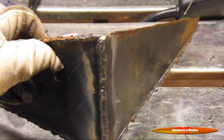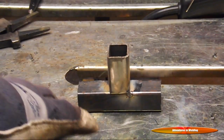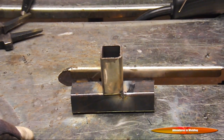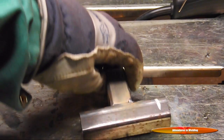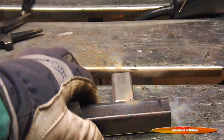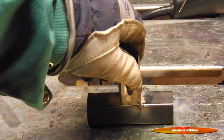Let's move on to the tubing joint. Here's our square tubing joint — I've already got it tacked and ready to weld. We're going to have two separate types of welds here. On these flat faces, this is going to be what's called a flare bevel groove. This is our first bevel groove on the flat side — I'm just sweeping back and forth across it as I move down the length. There's really nothing to this joint.